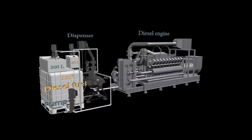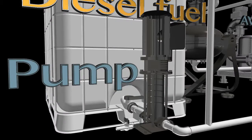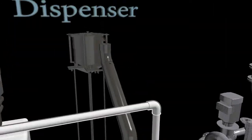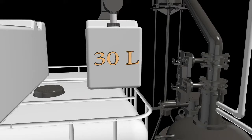The process line of continuous diesel fuel and water blending consists of a 1 cubic meter tank, a pump to supply fuel from the tank into the AVS-150 device, a feeder device to add ferromagnetic particles into the chamber of the device, a 200-liter tank with portioning pumps to supply water, and a 30-liter tank with a portioning pump to supply the emulsifier.